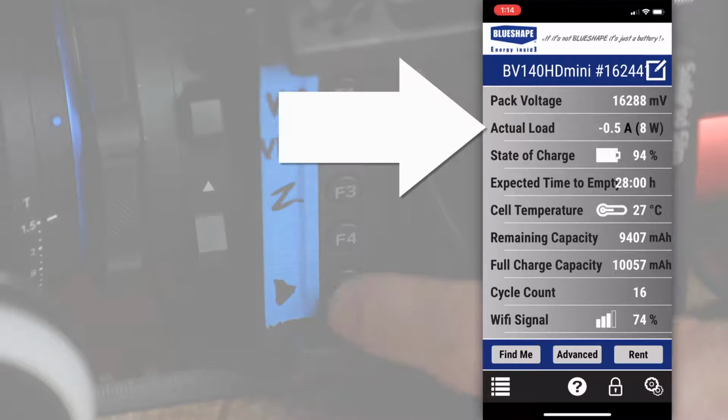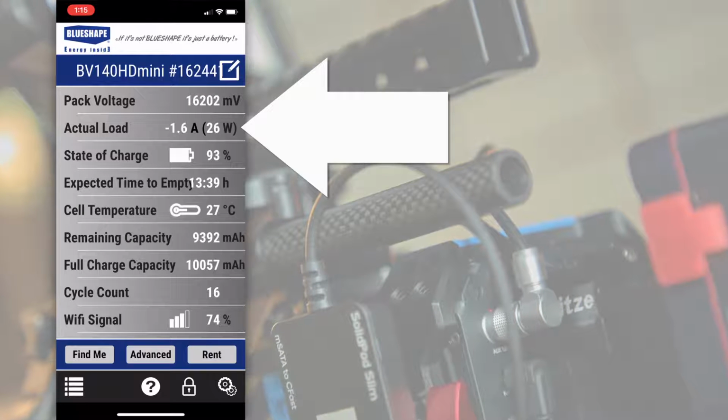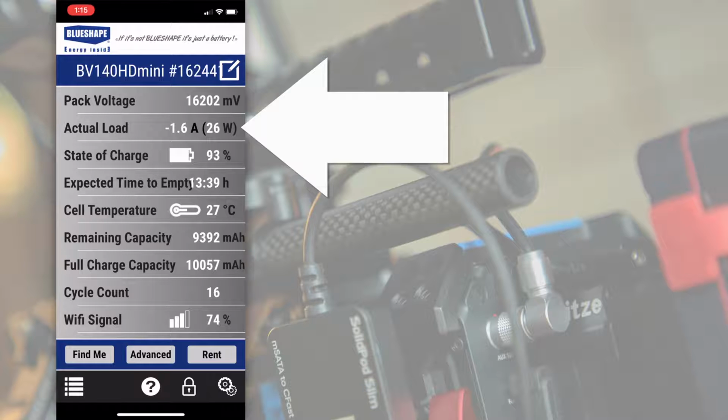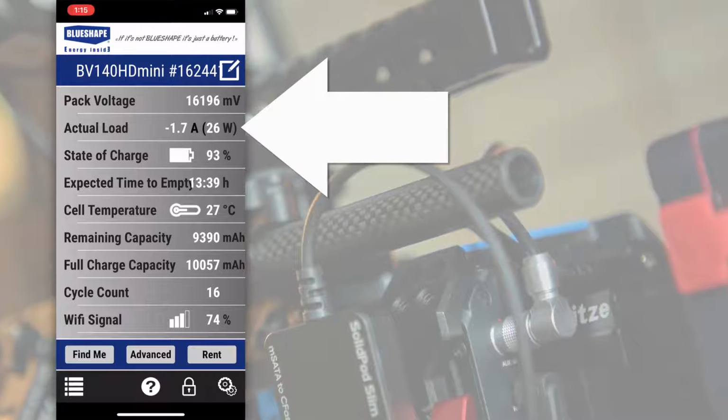I tried this two ways with slightly different results. The first way, using the power output from the Zcam E2F6 to power the monitor, then subtracting the camera's power consumption from that total. Here you can see that the E2F6 itself is drawing about 8 watts from the Granite Mini by itself. When we turn the Osee T7 on at full power, that jumps to 26 watts, meaning that the Osee T7 at full 3000 nit brightness added 18 watts to the draw on the Granite Mini.